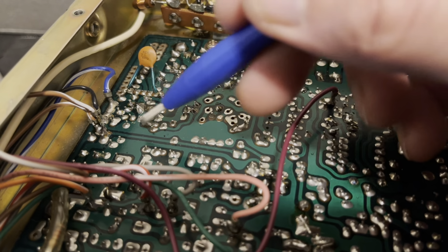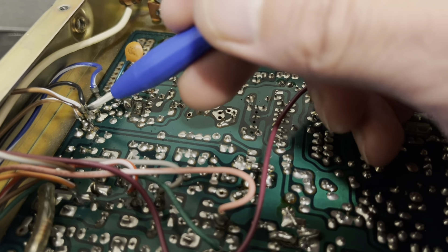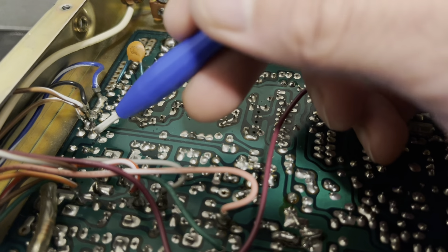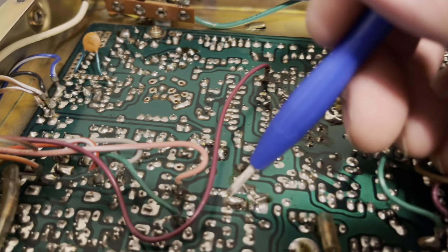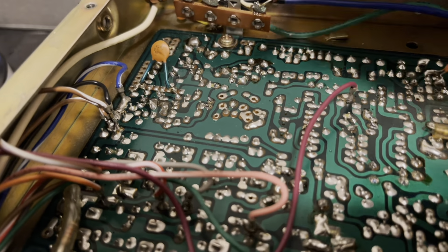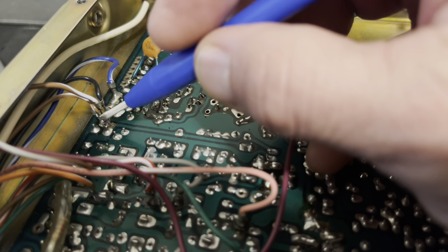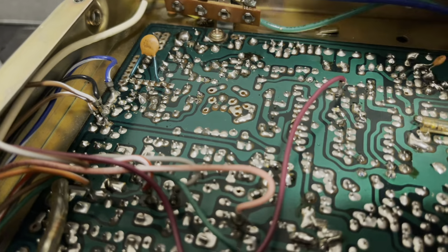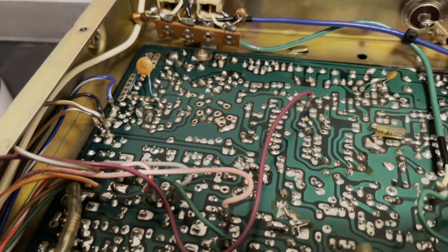The clarifier wire runs all the way up to here along that trace. It's on a small Molex pin, just like the wire behind it. I just lifted it from where it was originally, re-tinned the pin, and then soldered it along with the other pin right here to our constant 7.8-volt source. Now we'll move on to the next step.